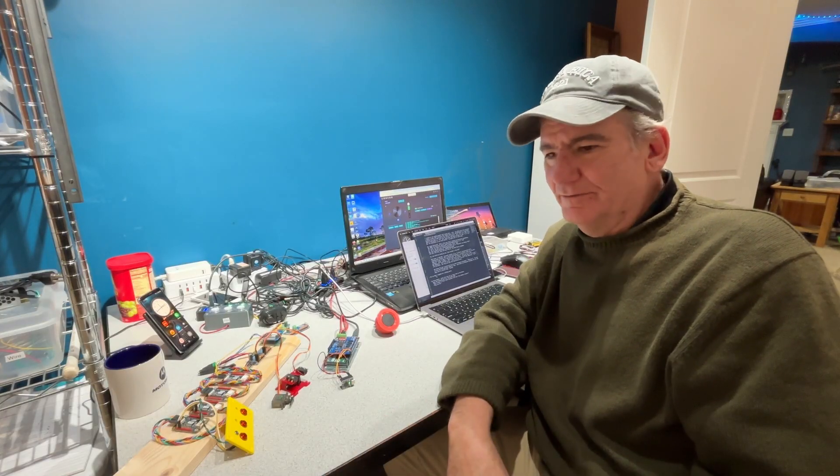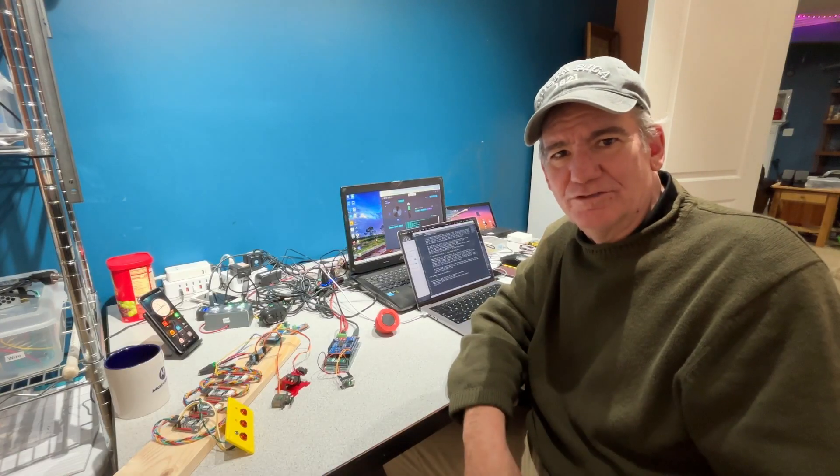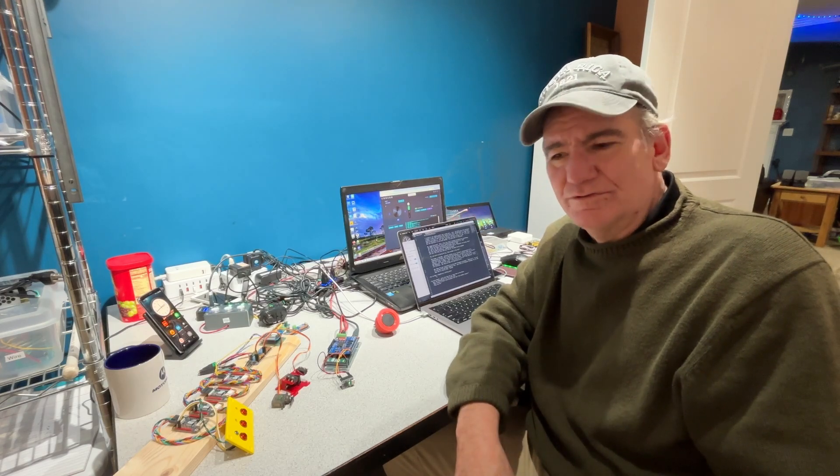Now we've got command station figured out, and we've got a little module that's going to act like a gateway to it. The big question — the elephant in the room — is how are we going to connect potentially dozens of different devices through this port without getting choked up? Wi-Fi just doesn't seem like it's going to work. I actually tried it and got all five of them connected, but they were sluggish — herky-jerky skips. It's just how Wi-Fi is: it's doing all this back and forth and all the encryption. It just didn't seem like that was going to work out in the long run.